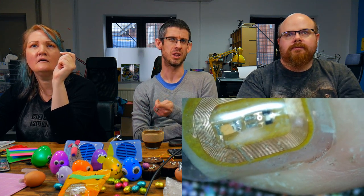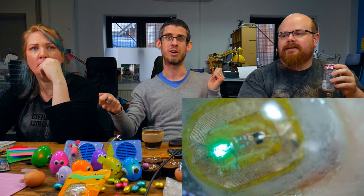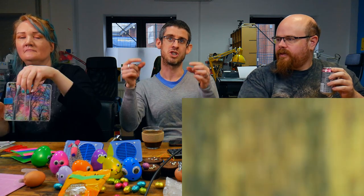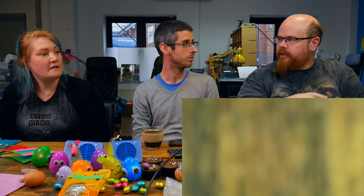We did a Bilge Tank episode last year where Phil and I made our own RFID or NFC LEDs. You can do it yourself if you get a length of wire and just make a coil. You have to experiment with the number of turns of the coil. Then attach the LED to either end of it. If you then make another coil and run power through it, you can get the other LED to light up. So that'll be Bilge Tank 90 something, maybe.